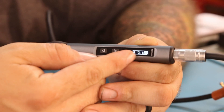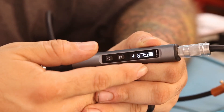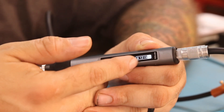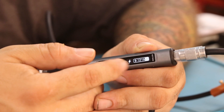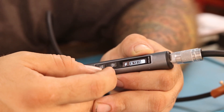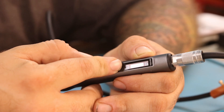There is a voltage selection, so you can actually set this to whatever voltage you would prefer. I leave it on 20 because I'm using that included adapter. However, you can dial this back if you've got a supply that cannot give 20 volts or enough current to maintain that, which is a nice handy feature to have.